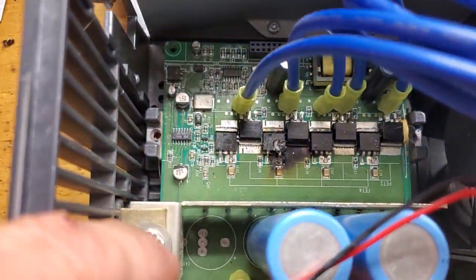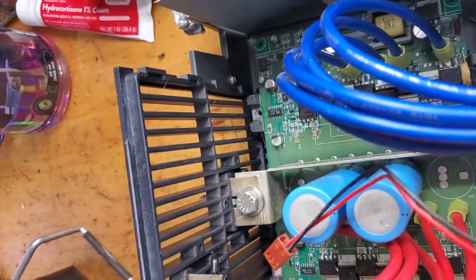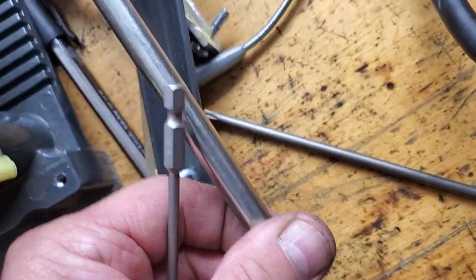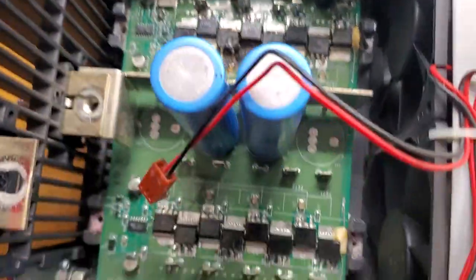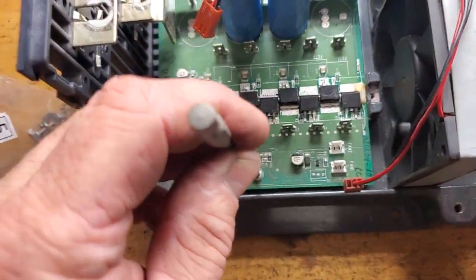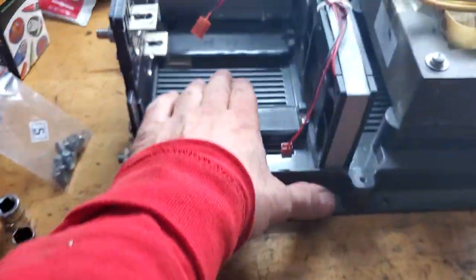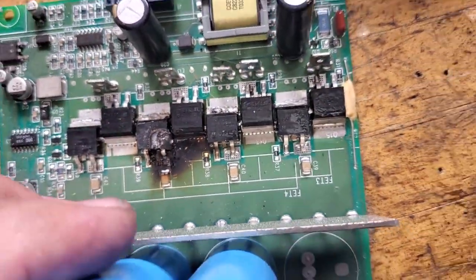Next I'm taking this off - positive comes off, negative comes off, and then this panel right here. We took that bolt off and that bolt - they're 11 millimeters. Then this screw holds that down, and two other screws held the cable board, the input board. Underneath it is heat sink tape to get rid of heat - that's what those fins are there for. And as you notice, a bunch of MOSFETs just took a dump - switching transistors.